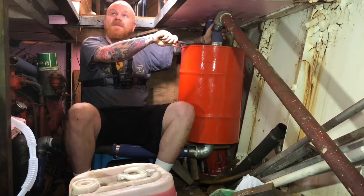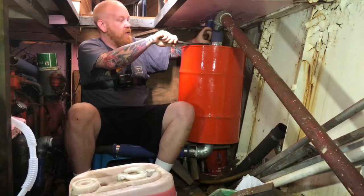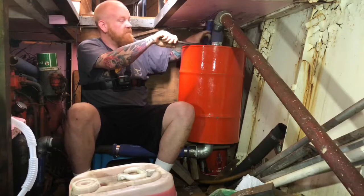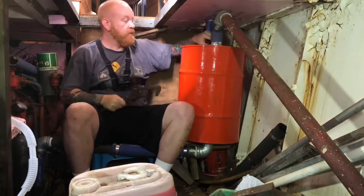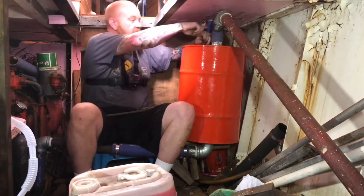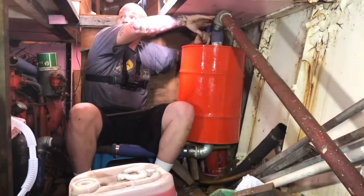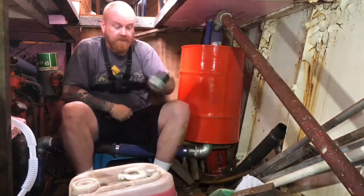In the 90 degree. Yeah, it will. That one. It'll be more low profile than what it is now, or you get a 6-inch coupler. A 6-inch coupler will thread into here an inch, and it'll be up to here. Then you put your 90 on top of the 6-inch piece instead of getting what?